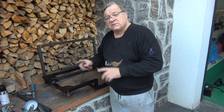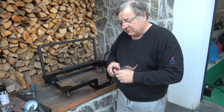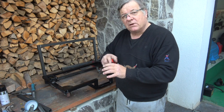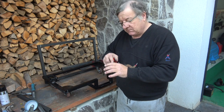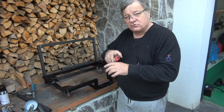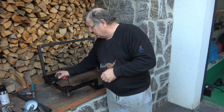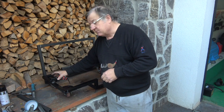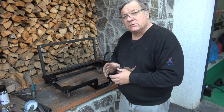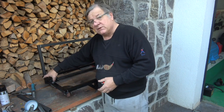But definitely the way to do this is to make the plate, take the engine mount and put it on, and actually mark the holes from the engine mount, and then drill them. If you've got a pedestal drill, that's brilliant, but if you can't, just drill them out and then make them so that they're as square to the plate as you can get. And then the way to do that is to actually bolt them to the mounting, bring the engine down, and whatever piece you're using for the side.